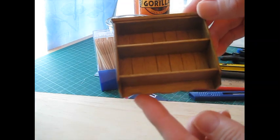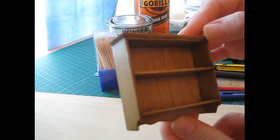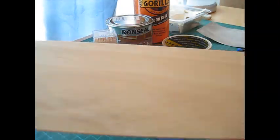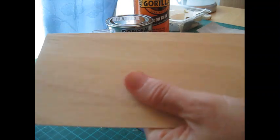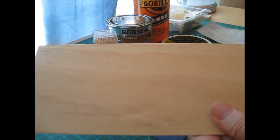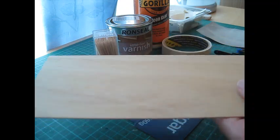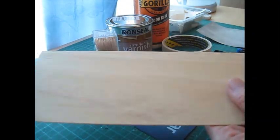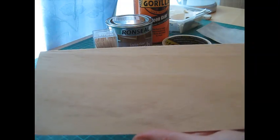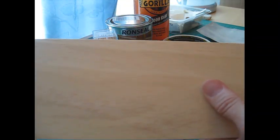This technique of shaping wood is really handy for other projects. The wood I've used is one of my favourites - basswood, which is just a soft craft wood. This is the 1.5mm thickness, or 1/16 of an inch. For the top of the shelf we use 2.5mm, or 3/32 of an inch. You just need the two thicknesses of wood for this project. You could use bass wood, lime wood, or jelutong, which is a really nice quality wood with an even closer grain.